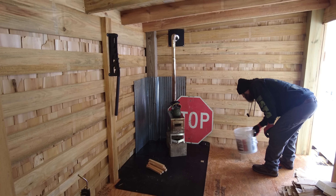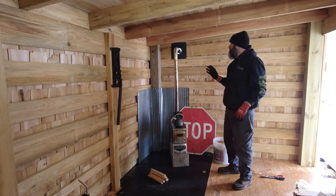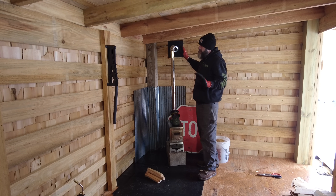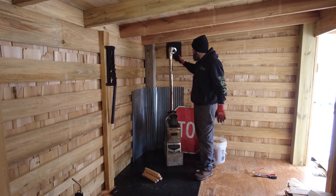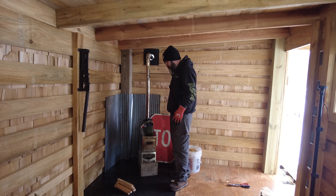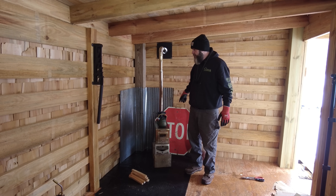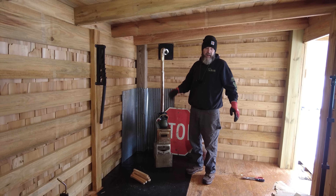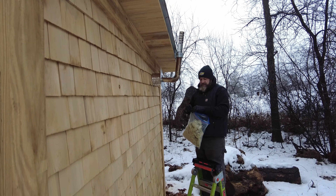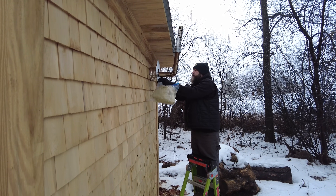We're pretty close on the install and I don't think we have enough time today before it gets dark to get this lit. This big thimble — they call this a three-inch and they call this a three-inch but they're different, like triple wall versus single wall. I'm going to get some rock wool to stuff around it, fireproof insulation to keep the drafts from coming in. I was going to get another piece of metal but we found this old stop sign in the shop — I think it'll work fine. I got a couple more things to hang up and then we're going to test this out and see how warm we can get it in here. This stuff is nasty — Gavin says it tastes worse than it feels.